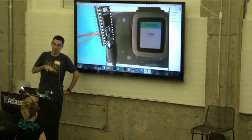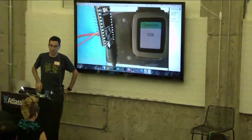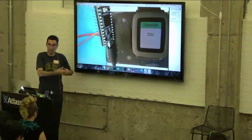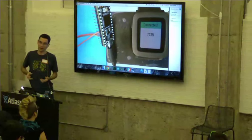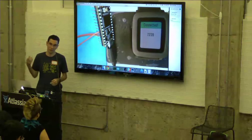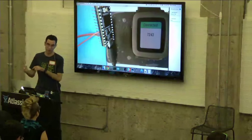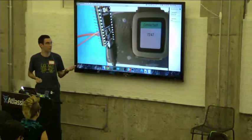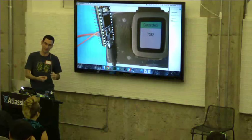Yeah, we handle that completely under the hood. Right, so the question was basically how does the app get notified when we connect or disconnect, and it's just through that availability changed callback. We also provide an API where you can pull the connection status of a service if you just want to know at a given instant if it's connected or disconnected. It just depends on whether you want to use callbacks or explicitly request it.